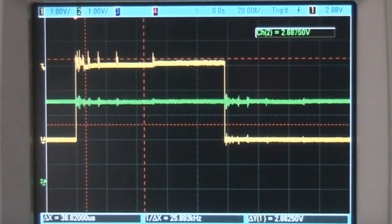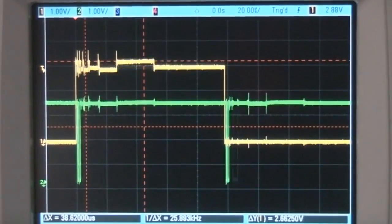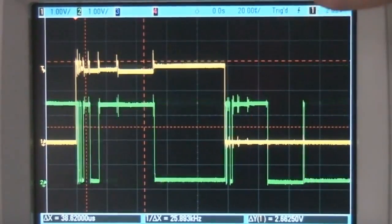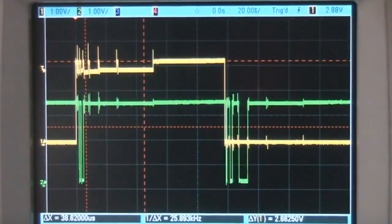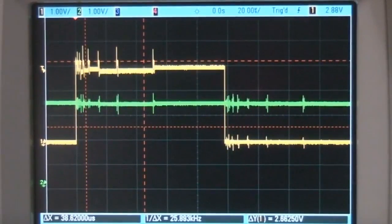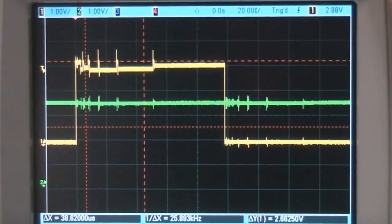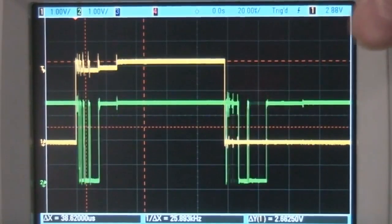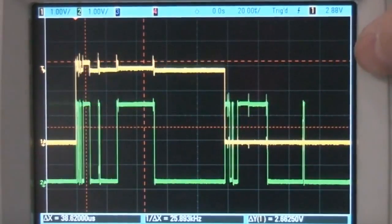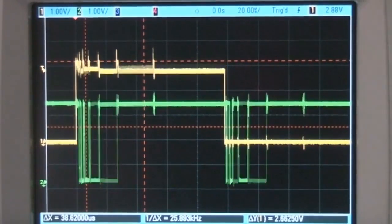So we will get a certain amount of ghosting. If there's a lot of columns on, then the row voltage is dropping and that's going to dim down that thing. It works, but it's not ideal. I think adding some row drivers is probably going to make quite a big difference to the brightness we can get out. And I've set the FPGA output pins to their maximum drive, so it probably is abusing the chip to some extent, but it does seem to work.